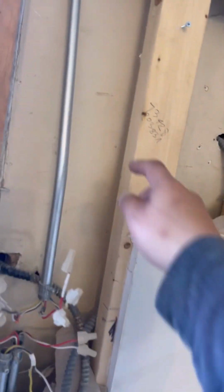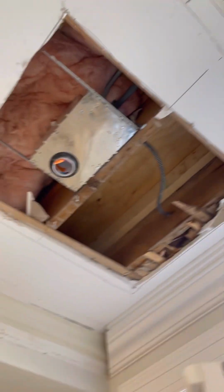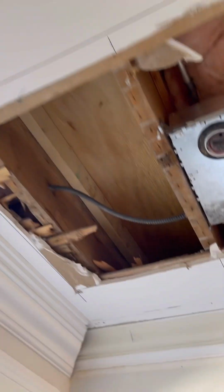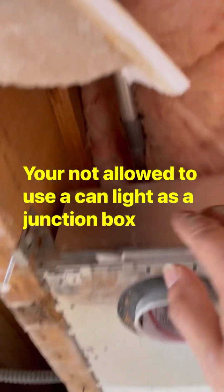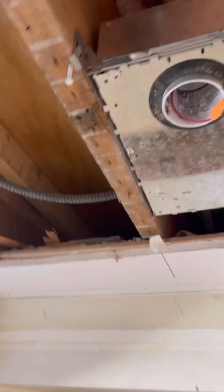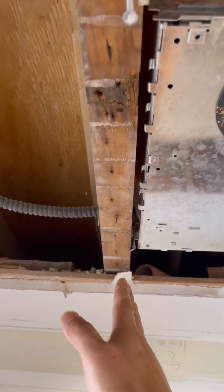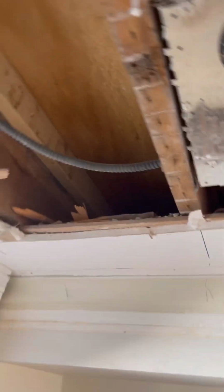All right, so here's the update, because technically this is a plaster wall, so they just ended up putting another wall on top of a wall. So I ended up just cutting this right here so that we can make the nice 3-gang box go here. And then technically this light right here, they want to keep the same light, and it has a lot of pipes. So it's got these guys, possibly with these 2 right here, and then it's got this guy right here. And this is another thing, you're not supposed to use these lights as a junction box for the same reason right here. But technically the guy said just cut this out of the way, and then they'll frame around it or do whatever they got to do, because technically our center line is like right here. I just need this thing to slide over just a hair. But yeah, we're gonna cut that joist out of there and slide this over, and that's it.